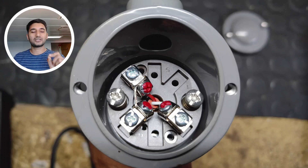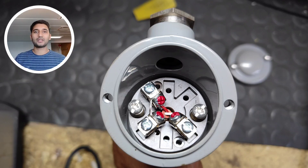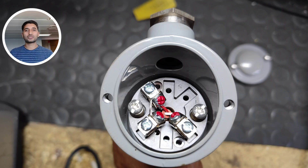With every single increase in degree Celsius, close to 0.39 ohms will be added. So approximately, if you calculate: at zero degrees Celsius it will be 100 ohms, and at 100 degrees Celsius it will be around 140 ohms.